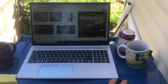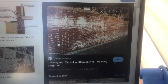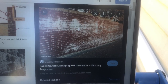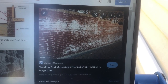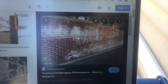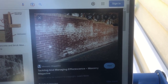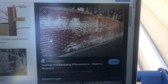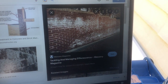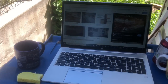Come over here to the computer. Here's a retaining wall — this one happens to be red brick masonry — and you can see this wall has likely been backfilled with dirt or doesn't have proper drainage. You can see all this white powdery stuff all over the face of the wall. If you start paying attention to this out in the world, you'll see it everywhere — it's an indicator of poor construction. The masonry should look like this darker, clean section here. All the rest is not draining properly. That's step one of what happens to your wall when you fill it with dirt.